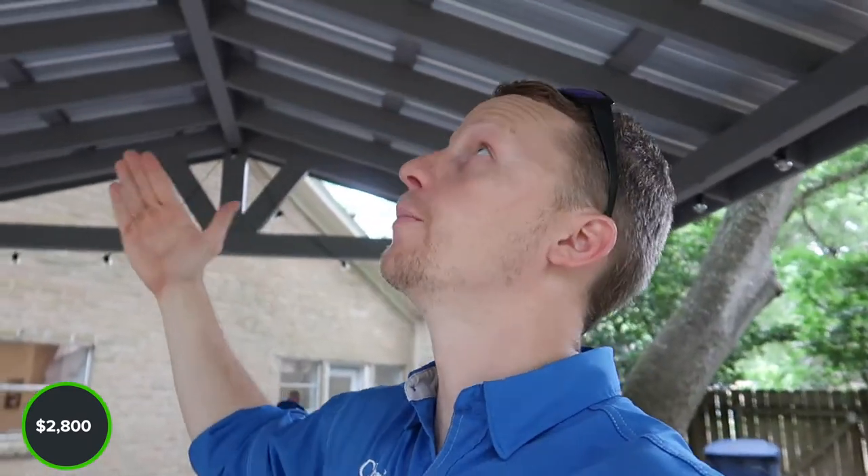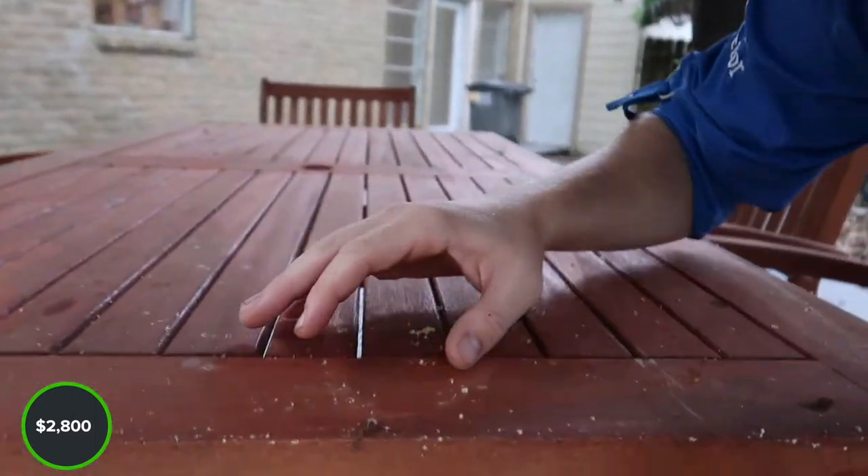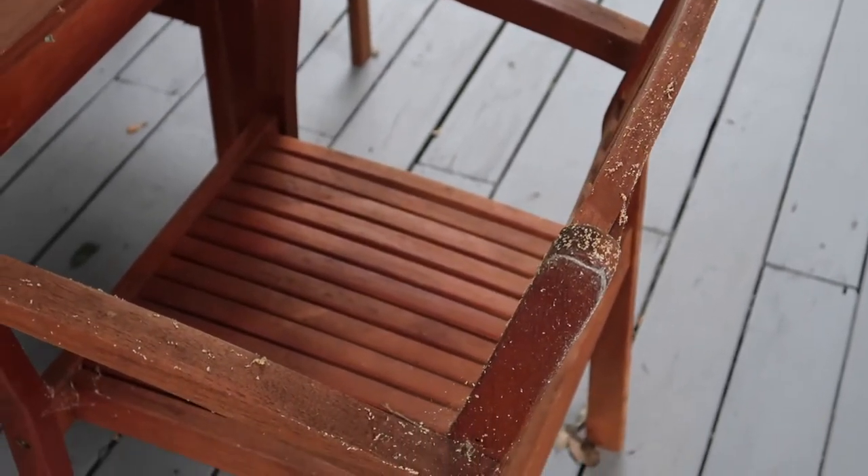The next find is unique to this pergola — it's not exactly attached to the property, but it can eventually lead to issues. We have carpenter bees in this area, about 10 holes. They create this perfect round hole, and they have frass — they poop outside of it and drop the external wood outside, creating this mess. An average cost for an exterminator to come out and start treating is around $400. Carpenter bees are a nuisance pest — they keep coming back and are harder to remove, so exterminators also set up traps for them.